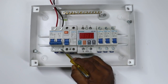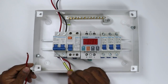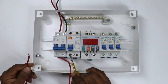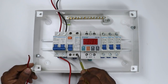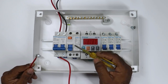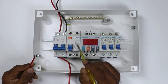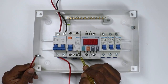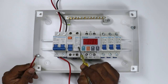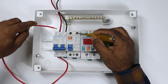Now, from the output terminal of this MCB, where we get phase supply, connect a wire — I am connecting this red wire. The output power supply through this MCB we have to connect with the RCCB. When you look at this RCCB, here it is written N — where N is written, you have to connect neutral power supply there, and where nothing is written, connect phase supply. A lot of people make the mistake of connecting input power supply on the wrong side. On this RCCB a diagram is shown: it is written 1, 2, N, N — where 1 is written, there you have to connect phase supply, meaning the upper terminal on the right-hand side. So I am taking this wire and connecting with this terminal.